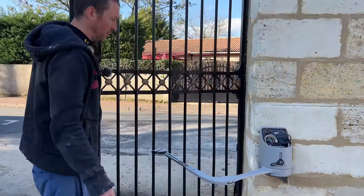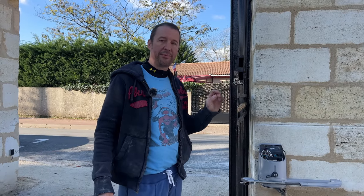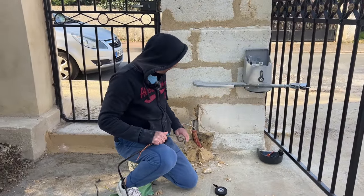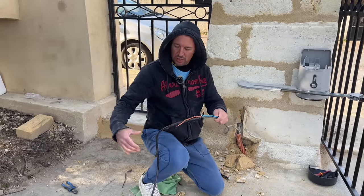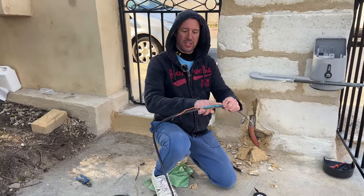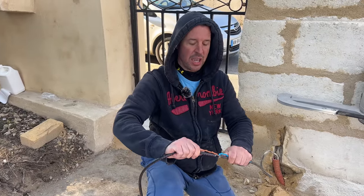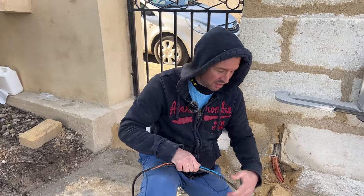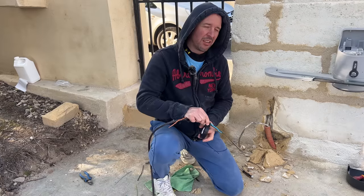The sad part is if you knew that from the start, and if it was in the instructions, we wouldn't be having this problem. No. I'm going to let you in on a little trade secret. What is that, Ed? Right, we've got a bit of room in here. It's not too bad, but when you haven't got much room and you don't want to tape two cables together, it takes up too much room. What you do is you twist a wire from each of the cables together, one that way, one that way, so whichever way you're going in the tube, it doesn't come undone. Normally I shouldn't have a problem. If this comes off under here, I'm in real trouble.